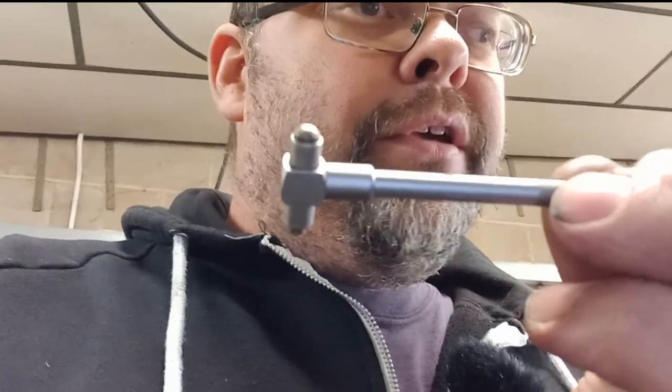Now I have set up that bar with a telescopic gauge, or measured it to make sure it's where we need it to be to start with, but because that's not a critical dimension, as in it's not having any O-rings or anything fitted into that particular bar, if it's plus 0.1 it doesn't matter, if it's minus 0.1 it doesn't matter. So I've got another one set up in machine now, and I'll take a video of that. Enjoy.